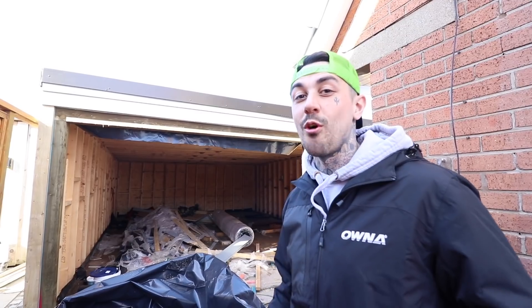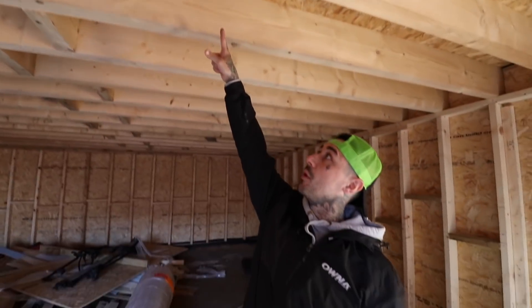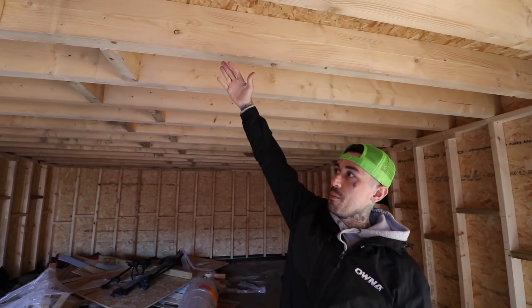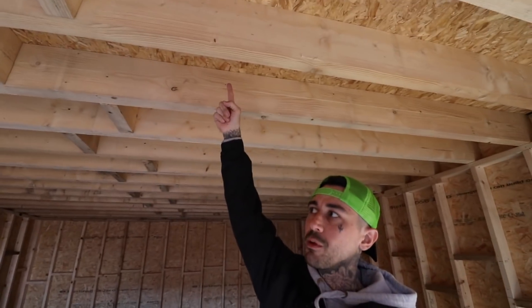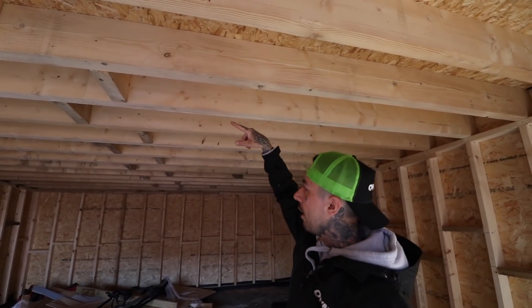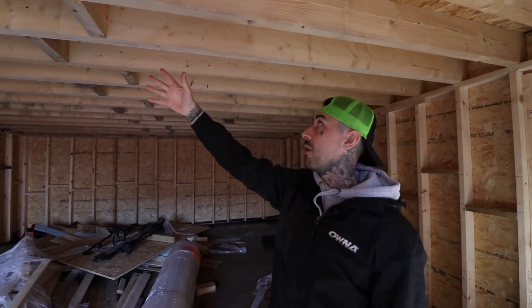So today we are going to be fitting the roller shutter door. As you can see, we've got 18mm OSB boards and the rubber sits directly on top of that. I used screws — someone who installs flat rubber roofs told me not to overload it with the nail gun from the top, because when the boards swell and unswell the nails stay stuck up. So it's screwed with 70mm screws into the joists. The boards are in, the rubber's on, and we are officially watertight, which is mega.